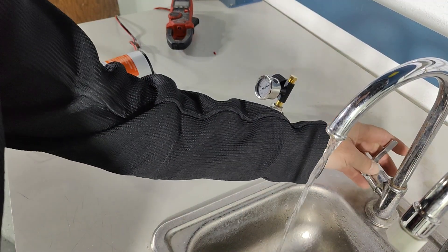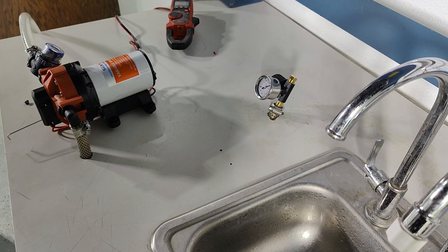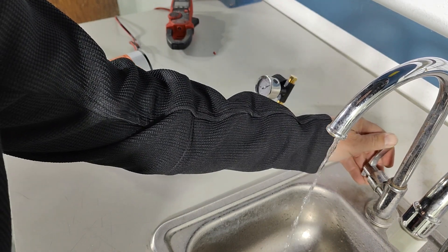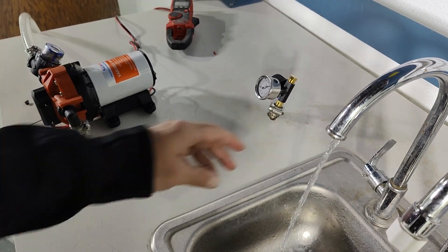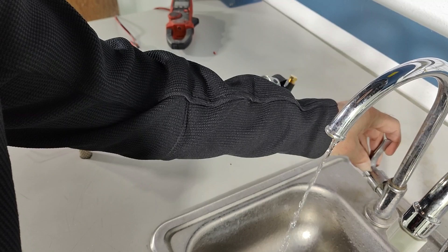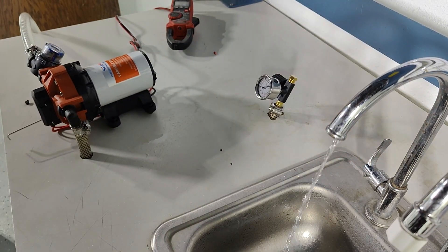The first thing I want to do is turn the pump off and make sure it'll stop. If you close the faucet but the pump doesn't stop then we've opened the bypass too much. So here we have no cycling at this very low flow — it's pretty dialed in. That's perfect.